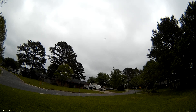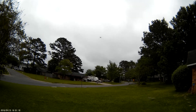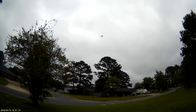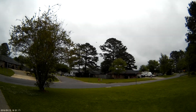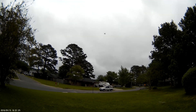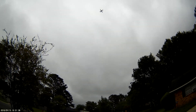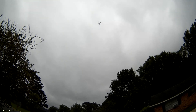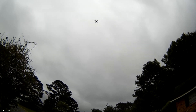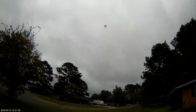All the trims are centered, it's holding position very well. The wind's not gusting right now. Let's fly around in position hold — nice and smooth, no crazy movements. Full throttle, pitch back — let off the stick and it is going to adjust. When you let off the stick in position hold, which is hybrid loiter, it is going to move around a little bit as it hunts for the spot it wants to stay in. That's perfectly normal.